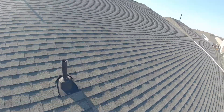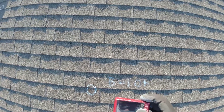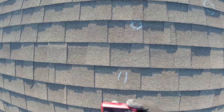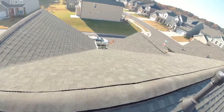It's important to take photos of the gutters because you want to prove there's no damage to those gutters as well. Not only do you take photos if there's damage — you're also taking them if there's no damage. No damage on the gutters. Let's go up and take a look at the back slope for damage. Pretty sure we're going to have 10-plus on that, so I'll go ahead and take my snapshot of the 10-plus. See the granule loss? This is a brand new roof — only a year old. Nice big divot. This should not be banged up like this. Either way, you've got 10-plus easy.